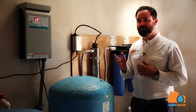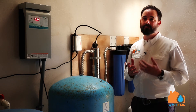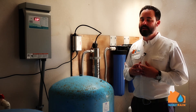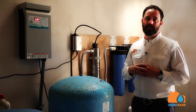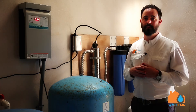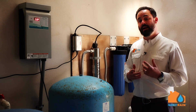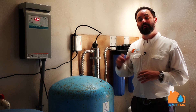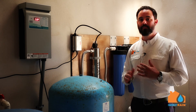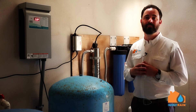You'll see right now it's fluctuating between 58 and 59 PSI — that's very important. Customers always want to know if they're going to have enough water pressure to wash out the soap from their hair. Absolutely. These pumps can range anywhere from 50 to 150 PSI, depending upon what our pressure needs are. Grade is the biggest answer for why you'd need one pump versus another. If the pump is very high above grade or very below grade from the home, that's going to fluctuate and change the dynamics of the pump, leading to a different type of pump need.